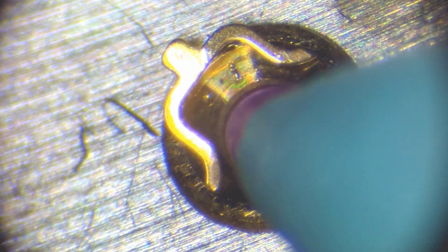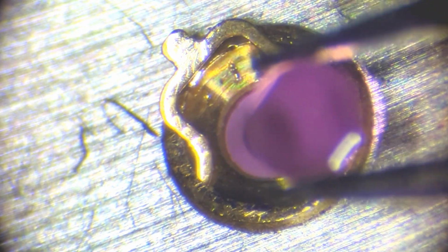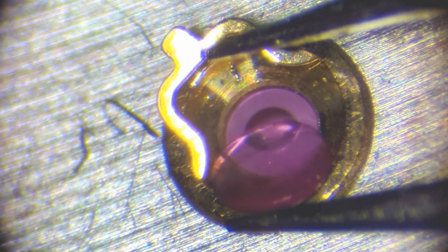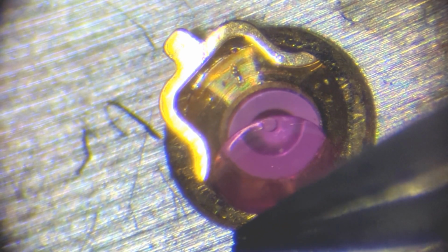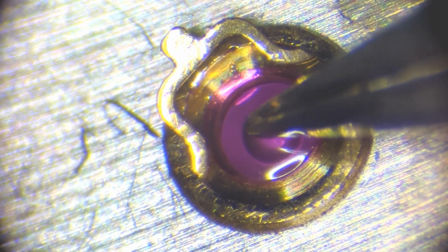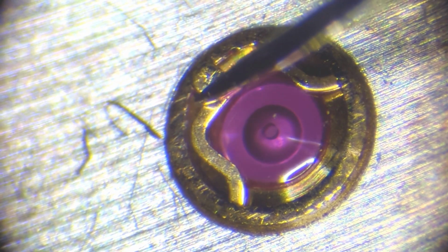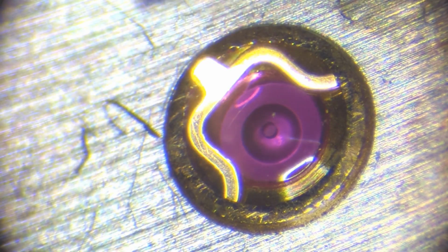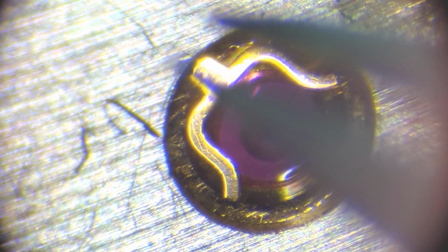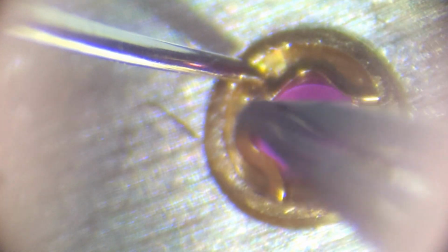After that I clean it using 99% IPA. And now is the tricky part of putting the jewel and spring back in place. If I don't touch the spring's arms, it has no freedom to get out and disappear forever. I don't lubricate the jewel at this point because I don't want it to slip away when I close the spring. It will make the task almost impossible, and at least it will smear the oil across the whole area.